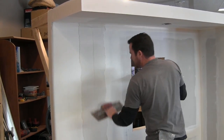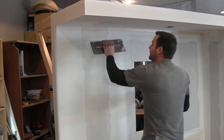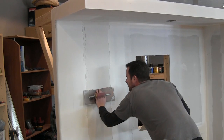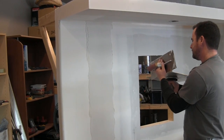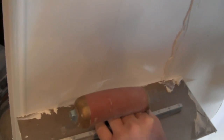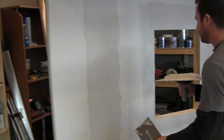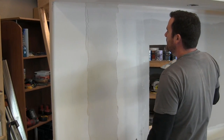I'm pushing fairly hard so I can get it worked out to the sides, pushing that mud out to either side of the trowel. Now I'm just going to go lightly so that I can hide that pencil mark. I'm going to hold my trowel up to the corner bead — it's going to be hard to tell how straight this is, but we're just going to try it.